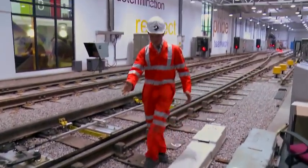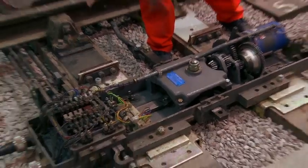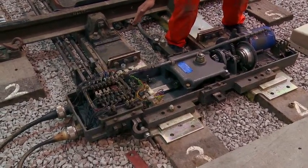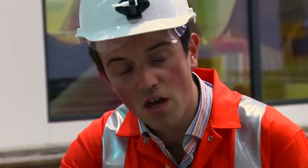This is an HW2000 points machine — this is electromechanical. What we have here is your drive motor. To check the motor has done its job, over here we have an interlocking and detection system. Detection tells us when the points have completed their travel and locked. Locking holds the points in this state so they cannot be physically moved, so when a train runs over the top, it remains in position.